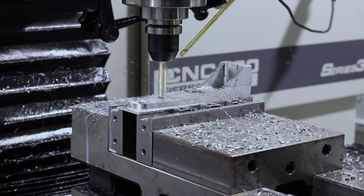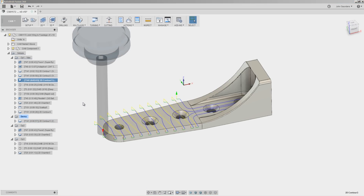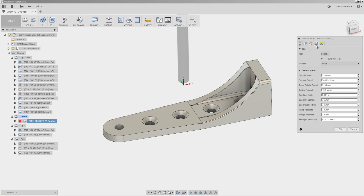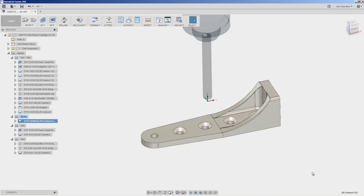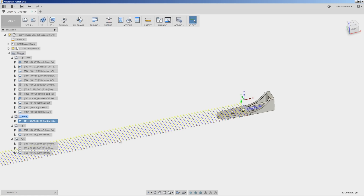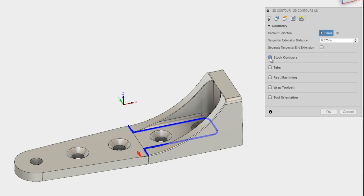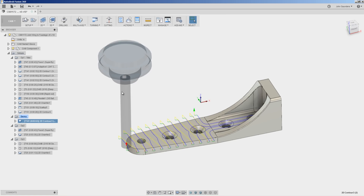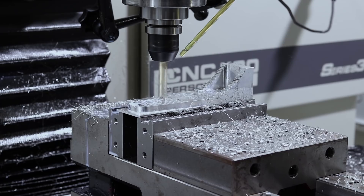Next up, some cleanup passes — we didn't want to use a horizontal, so here's a pretty cool trick that's underutilized: it's a 2D contour with roughing passes turned on. If you program a relatively large number of stepovers, say 100, it creates way more passes than needed. But go back into edit, geometry, stock contours, choose the outside profile of the part, and it will now limit the roughing passes to the selected stock. A really nice way to contain that toolpath — a lot of times we prefer the look and cutting action of this over the horizontal.